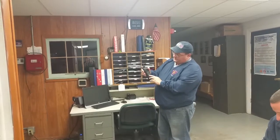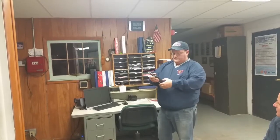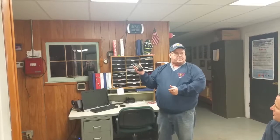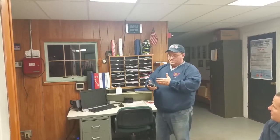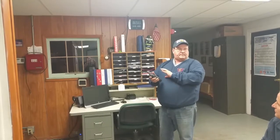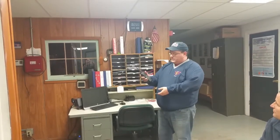Next buttons are the home button. You hit that, and it basically takes you to your dispatch channel, your home channel, that the radio is set on. If you've gone off it, you can hit home, and it takes you back to it. If you're going through zones, and we've jumped down to Johnson County, and now we want to make this radio Johnson County North, because we're going to work in Johnson County on this fire that they're working, we hit home. This radio is now locked in Johnson County, and we can talk to Engine 52. They just got disregarded on the run, or we can be on that run with 52s, and now this is working in the Johnson County mode by hitting that home button, and it won't revert back. When our dispatch hits up, we're not going to hear him, because now we're in Johnson County using their system and dealing with their dispatcher, so we locked it in by hitting the home button.